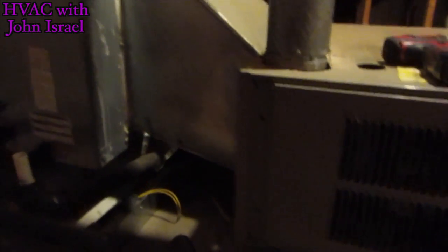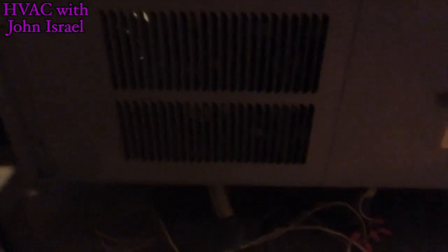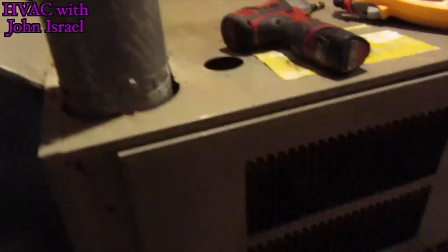They told me to go ahead and do a maintenance on them, clean them, all that good stuff. So I'm gonna pull the furnace open, check out everything, check the drain. Doesn't look too bad. That's an old Goodman furnace there. Glued that little stub. Coil is from 2010. This is CSCF1824 from 2010. So, got nice beer can cold, but we're gonna check the refrigerant in it. But this is actually not a terrible looking install. I've seen a lot worse.